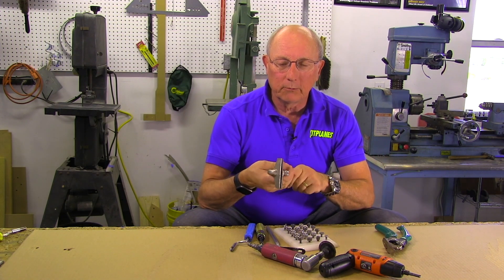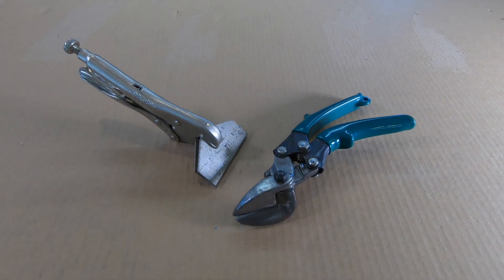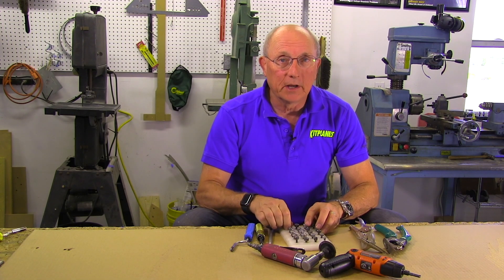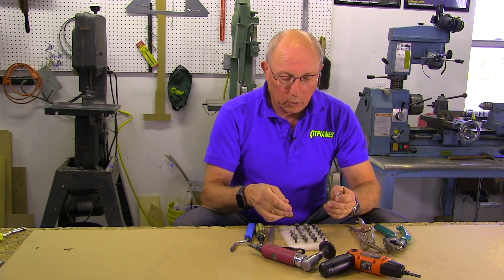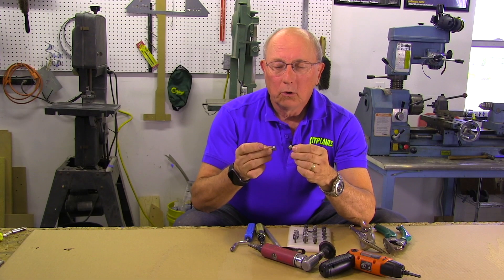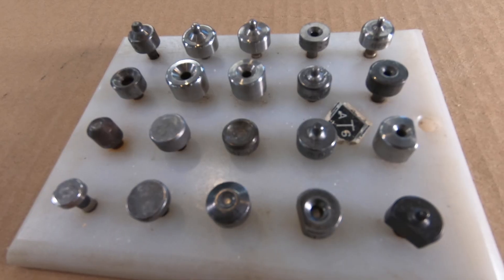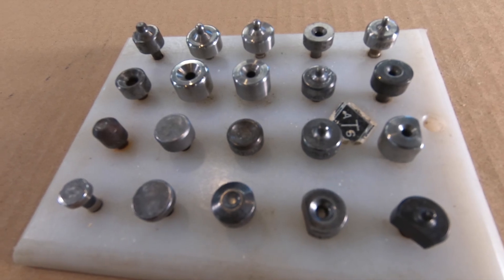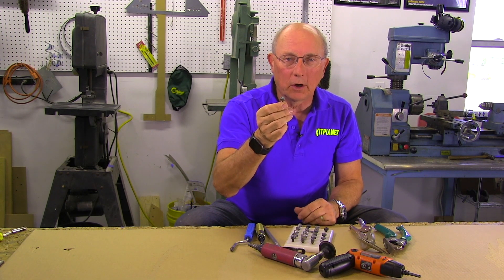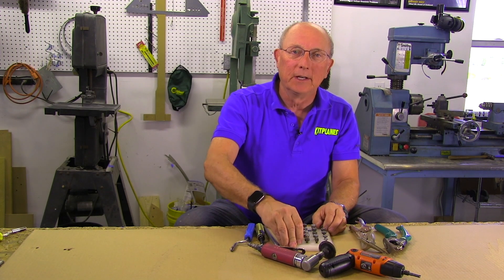There are a variety of tools I can represent with this seamer — something you can bend edges with. You've got a broad mouth that you can grab and make a nice even edge. One of the things you're going to do a lot on a metal airplane these days, like an RV, is dimpling. You'll want a whole set of dimple dies — there is a male and a female. You'll put these in a squeezer or a C-frame and they will create dimples for countersunk rivets so they sit nice and flush. You'll often end up modifying tools — taking a dimple die and grinding an edge off to get it close to a flange. Modifying tools is sometimes hard when you've just paid a lot for it, but it's just part of the life.